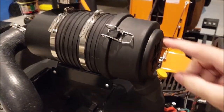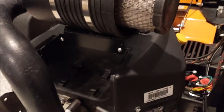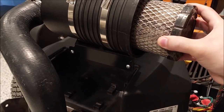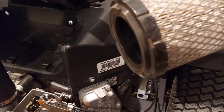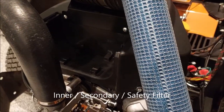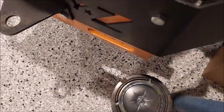Let's do this. Let's take this one apart, one-handed. This one is a little dirty - I have cleaned it inside the cap and whatnot. These you don't really want to pull out and put back in repeatedly. You've got to make sure it seals going back in. So let's pull out this filter. It's still good, there's a lot of media on here. Here's the inner filter - I think this is called the secondary or the safety filter.